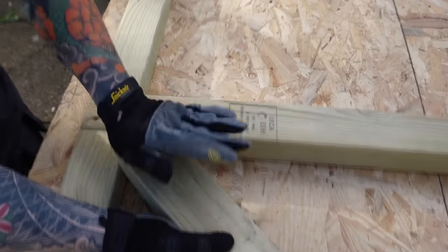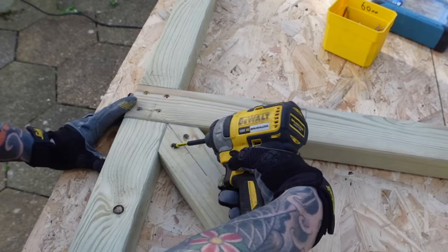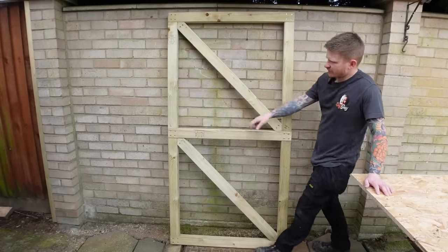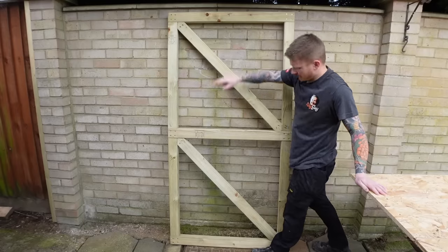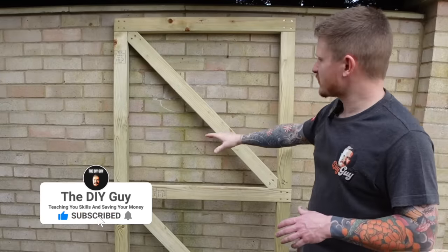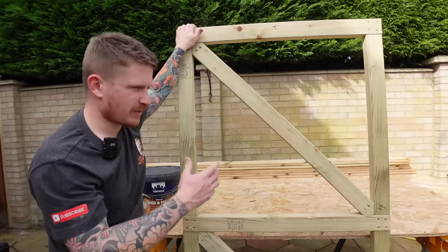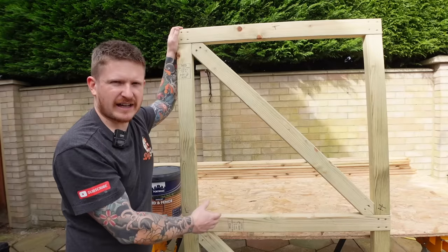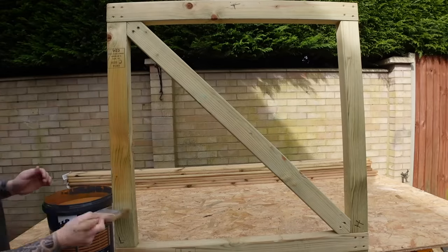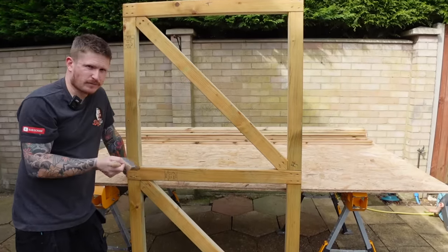You want the brace to be a nice snug fit, then just fix it in place with screws. The cross braces are now in — hinge side and latch side, top and bottom. We could put loads of weight on that top corner and it would never sag because of the compression on the cross braces. Although this is tanalised timber so it shouldn't rot, I just want to put a little bit of stain on the side that's going to be clad, because once it's clad we can't reach it. A nice touch of light oak — we can finish staining it later.